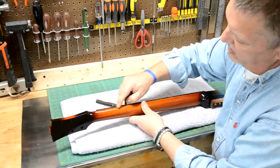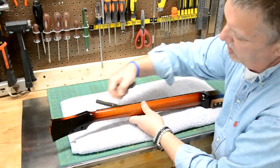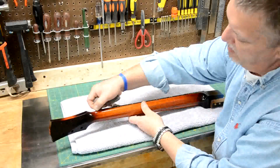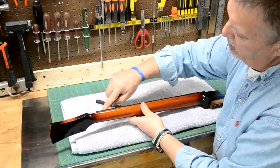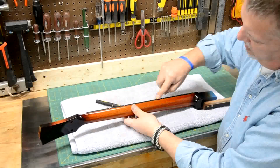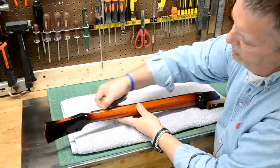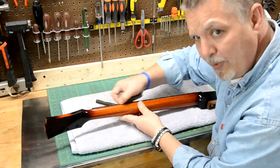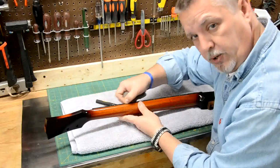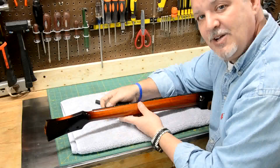You may feel a slight depression over the dot, which is where the lacquer has been removed, but when we start clear coating, we will actually coat that back up and level it. This also, steel wool, will help clean the ends of the frets, where you may see some color toner as well on them. So we want to get everything all shiny and clean, and the things that don't have paint, we want to make sure they don't have paint on them before we start clear coating, because the clear coat seals it all, and it's all done from there.